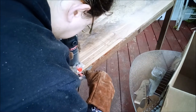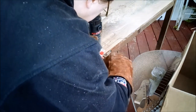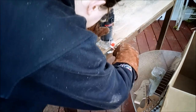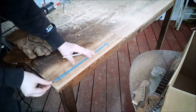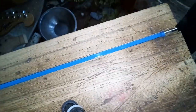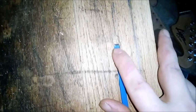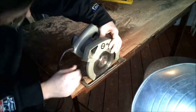This 80-year-old oak — hardwood is an understatement. Now it's time to measure the deeper heel end of the truss rod slot and hog that out, though I got a little overzealous. The truss rod is bedded in under the surface; I left a little gap at the top so it can do its work without binding. I overcut that heel but it ended up not mattering in the end, as you will see shortly.